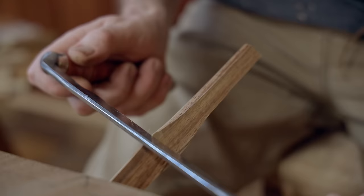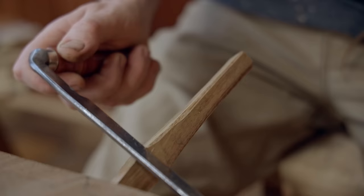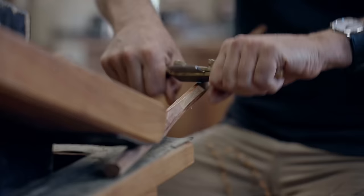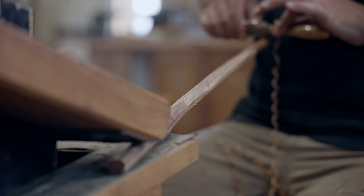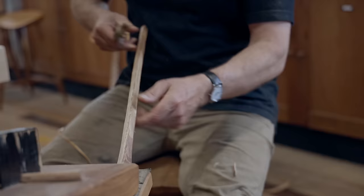What you can do is, rather than having your, and this is a fingers and thumb situation, it's not trying to ride it like a motorbike. His fingers and thumbs there like that. If you're finding that springy or it's pushing down and vibrating on you, you can change the position, even up those facets with the spoke shave.